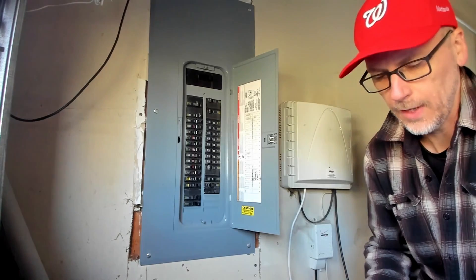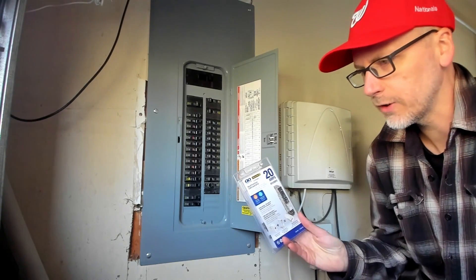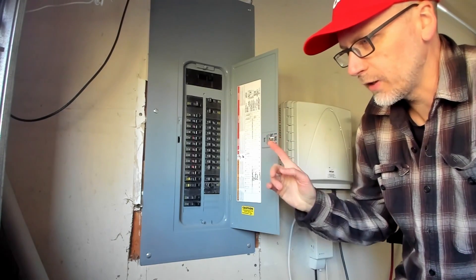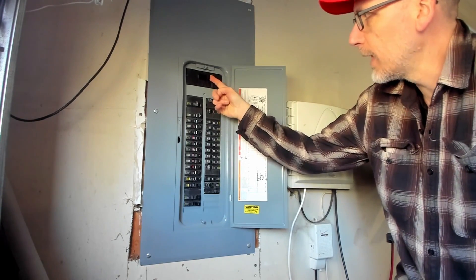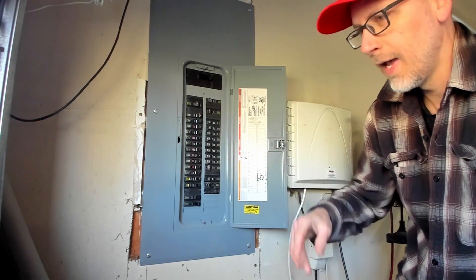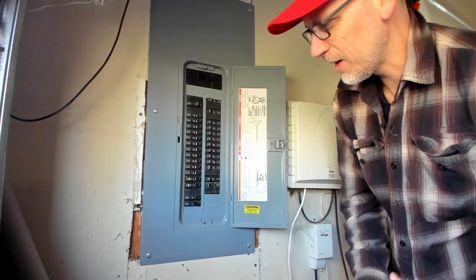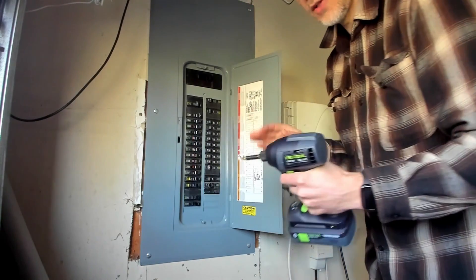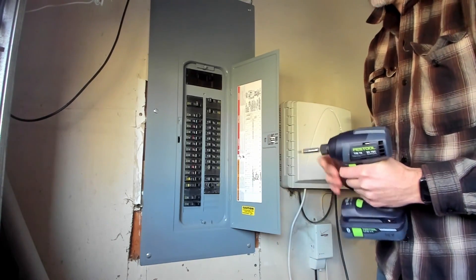It's actually a little strange. So this is the one I'm going to be replacing it with - it's actually a GFCI and also arc fault. The first thing you need to make sure is electricity is off. You'll normally have a main circuit breaker up here that you can turn off. We're going to have to turn that off because we're replacing a circuit breaker, so we don't want any power. I'm actually going to go outside and turn off the whole circuit's electricity.